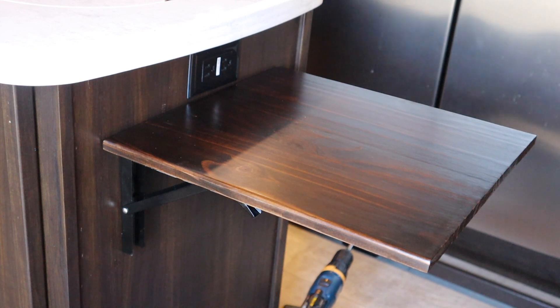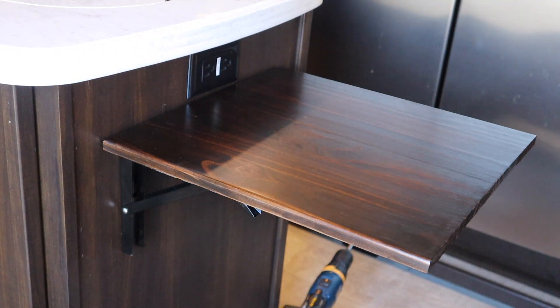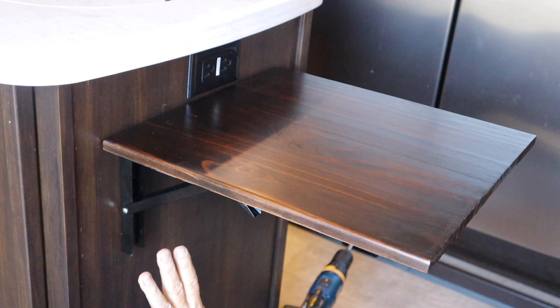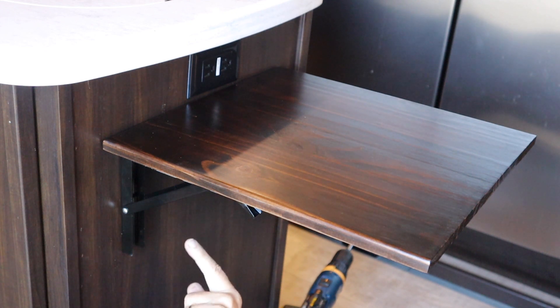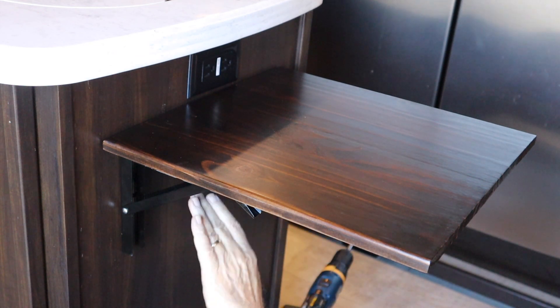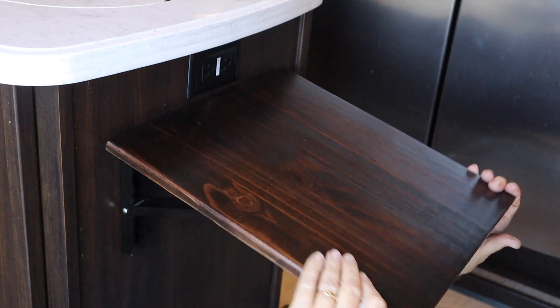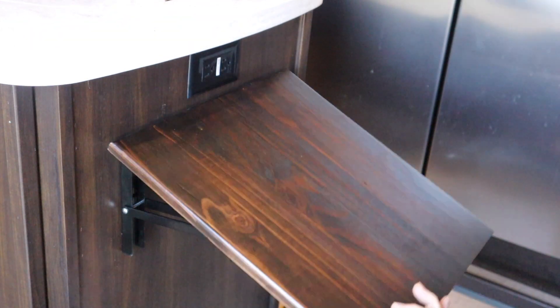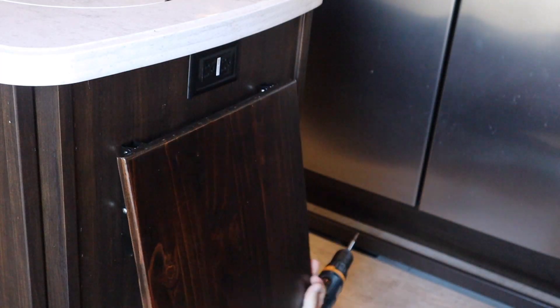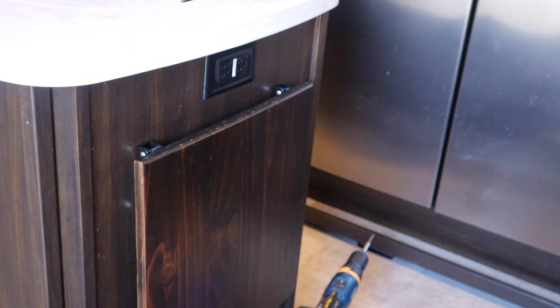We have the shelf in now. I learned something: these very top screws, I'm not going to put those in — or even drill the holes — until the very last thing, so we can put them in on an angle. Otherwise, trying to go in straight is way too much effort. Going in at an angle is actually going to be a better hold for the screw and a heck of a lot easier to put in. The bracket drops down like that and back up like that. And look at how it matches — it matches really, really well. John did a great job matching the wood.